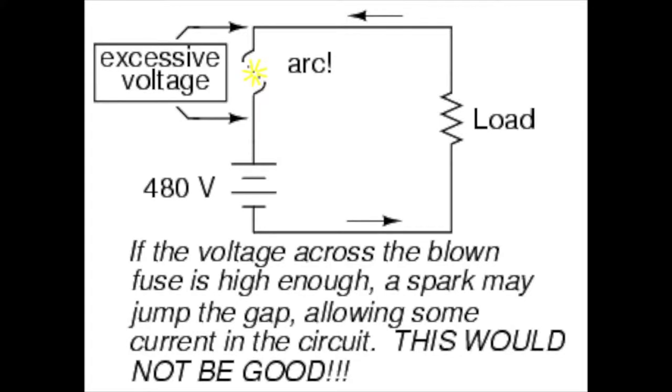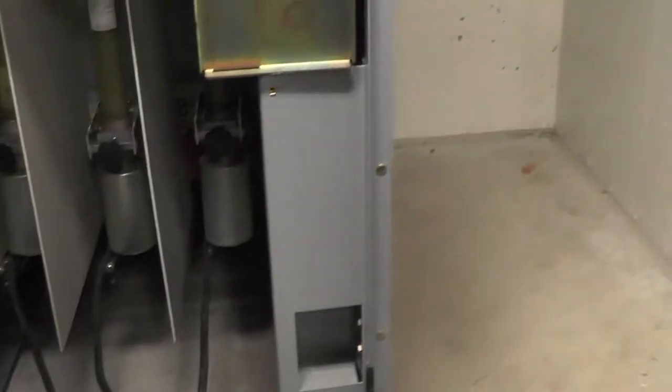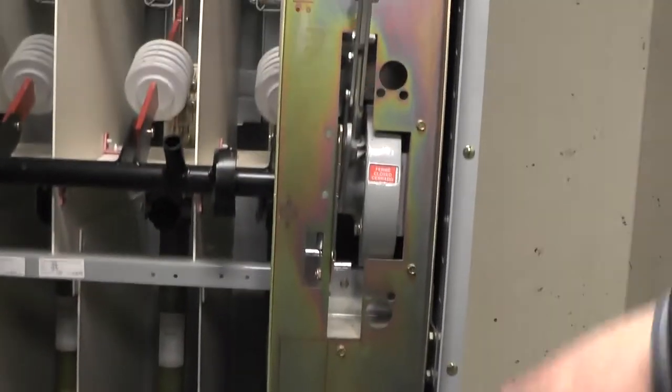The transformer feeds all the breaker panels in the area it serves. And when water gets into that cabinet, those fuses can arc to the other metal in the cabinet, because the water vapor gives the electricity a pathway to travel to the grounding. The water was cascading down through the chute — there was water all over the floor, running out of the conduit.